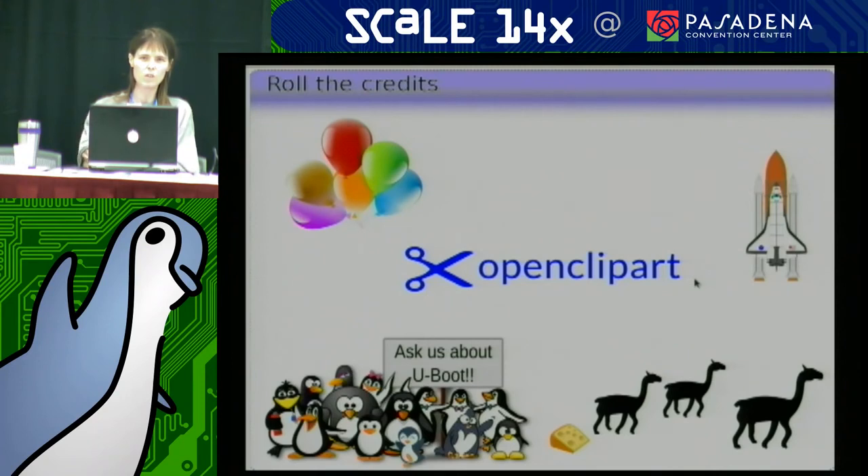Doing an upgrade from U-Boot rather than from Linux? Because we're using a normal version of the end-user software, which may not be optimized for programming updates. So what U-Boot does is it will load a special programmer version where you have everything you need in the initramfs, and that is where your MTD utils get installed — they're not necessarily installed in the normal application-focused build. You boot into the special programmer.